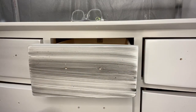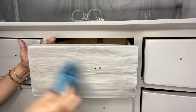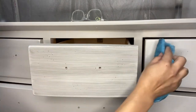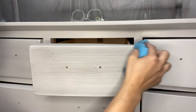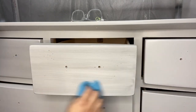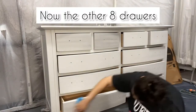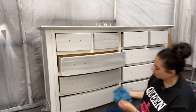Here's the second drawer front and I'm doing exactly the same thing as the previous one. One thing I forgot to mention earlier: I mixed the glaze with a 50/50 solution — 50% glaze and 50% water. The water is the medium that gives me the most amount of time to work the glaze. There are other products and extenders that people use, but when I mix my glaze with water I'm able to literally work on it as long as needed with no time constraints. Now I'll move on to the additional eight drawers in a time lapse.